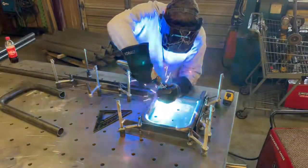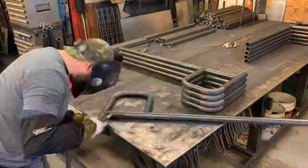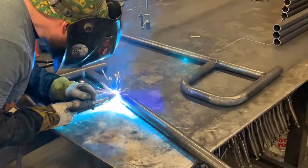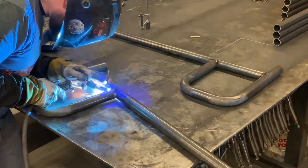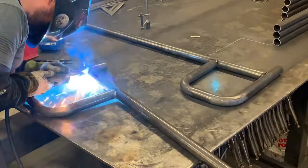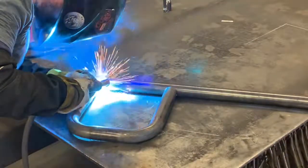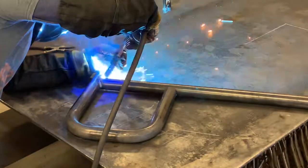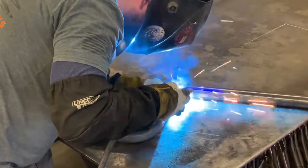Get all these welded up - just run your welds all the way around your hoop on your rail. We try not to weld a lot on our jig table just to keep the spatter off of it, so we'll do most of the tacking in the jig, then slide it over to the other table and get everything welded up solid. Once those pieces are tacked together you don't really get a lot of pull, so you don't have to worry about it warping. If you had more pieces - like when we start tacking them together with the cross, the top and mid rail - we've got them clamped together in another small jig just to keep it from bending and warping from the heat.